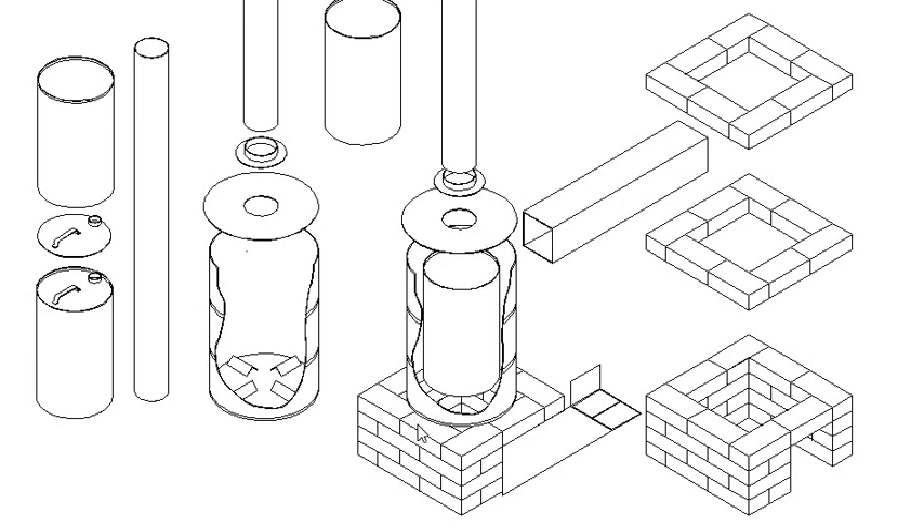Because this is separate modules rather than the original all-in-one design which you burn once it's up to temperature, this one gives you a little bit more finesse in terms of how to maintain that fire. When you disassemble these things you've got the outer drum and the inner drum as more separate units, rather than the original where you can't take that off because the fire is all around it. I'm not sure how this would transfer in terms of getting the same temperature into that inner drum as fast as the original system. But what you could do is if there was welded wire mesh on top and the drum sat on there, you could actually fire it up similarly to the original but you'd only need a small amount of wood to get it going, and then continually feed stock through the rocket stove part as well.